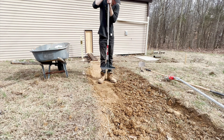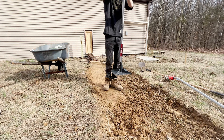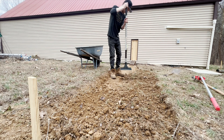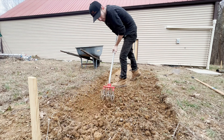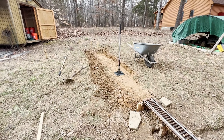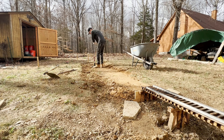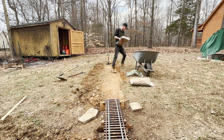It's hard to show you guys the natural gradient of this hill on camera, but the upcoming mainline cut is going to be pretty significant — at least two and a half to three feet deep in a couple of places, even maintaining that one and a half percent upgrade into the hill. Doing it all by hand is going to be a heck of a lot of work. I definitely might rent an excavator or some sort of small equipment to help, but it's been super fun and rewarding thus far. They'll have a nice roughly 500-foot stretch up a one and a half percent upgrade to wake up that fire, get everything burning good and hot, and ready for the day's run.